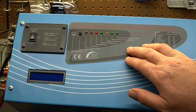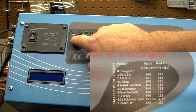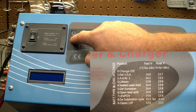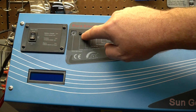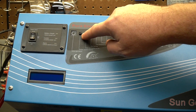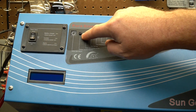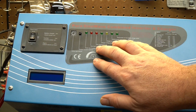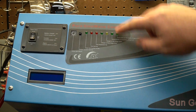There's another set of indicator lights and a couple of adjustments on this panel. The first adjustment is the battery type — since this has a built-in battery charger, it needs to know the battery type so it can charge it appropriately. The next one is a dial that lets you fine-tune your charging current. If you have a small battery bank you might turn it down to about 25%; if you have a large battery bank, turn it all the way up and this unit can provide up to 90 amps of charging.